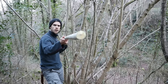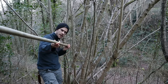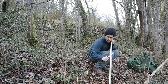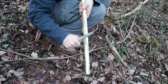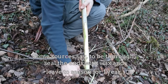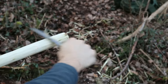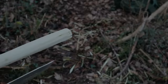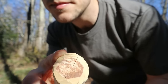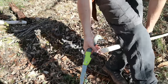The wood is easiest to carve when it's still green, so I would do the majority of the carving now to get close to your desired thickness, but still leave plenty of room for error before you dry the wood. There are lots of different opinions on how long to dry or season your wood to get the best strength and avoid cracking, but I just dried mine at room temperature for about a week. I did find a couple of small cracks in the end, but that's why I harvested the stave longer than needed so I can trim those bits off.